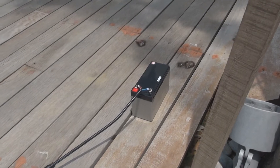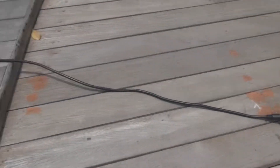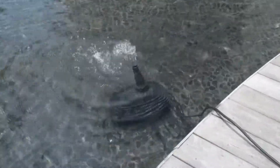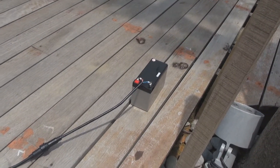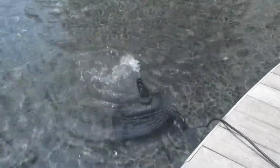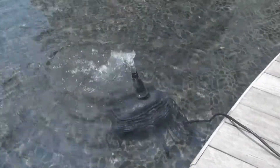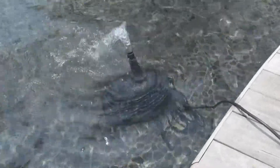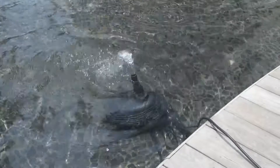What I have right now is the brushless pump connected to a 7.2Ah battery, hooked directly to the pump. I didn't bring a solar panel today because I was unsure about the sun conditions, so I hooked it to the 7.2Ah battery instead. Of course, if you connect it through a solar panel, the water output will be slightly greater because a solar panel can produce up to 18V, whereas a 12V battery only gives about 12 to 13V. The slightly lower voltage means the water height will be a bit lower, but it's good enough to demonstrate how well the brushless solar pump performs.